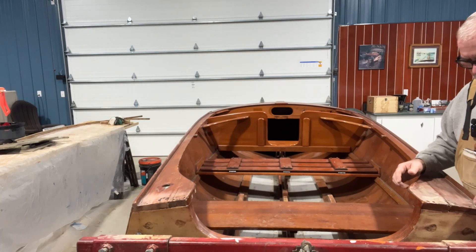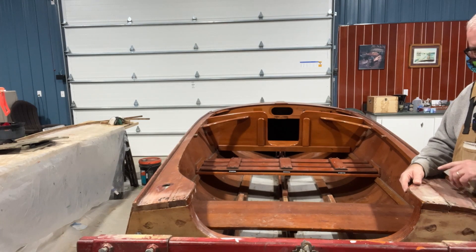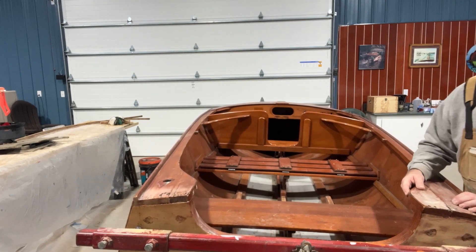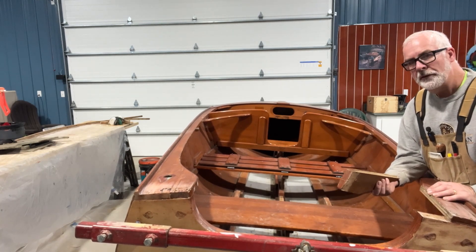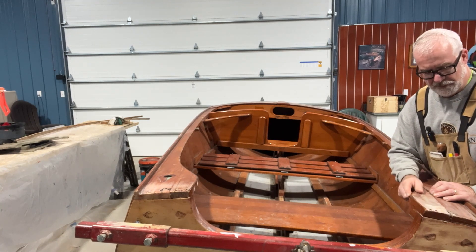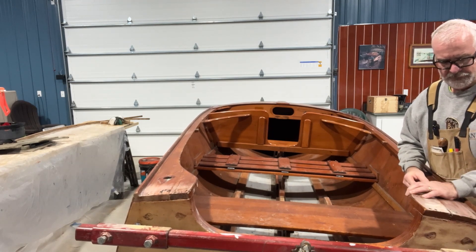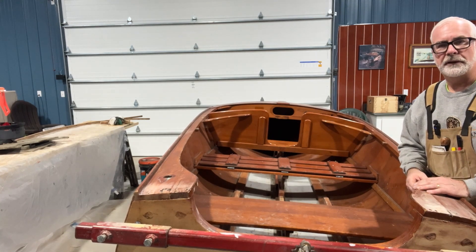I sanded, looked, nothing. So I just used an oscillating tool and took that fastener off and it came right out. I'll go ahead and do the same with it — clean up the bottom, clean up the joint without messing around with the factory joint, and then I'll clamp those really tight. Tomorrow I'll put the fasteners back in.